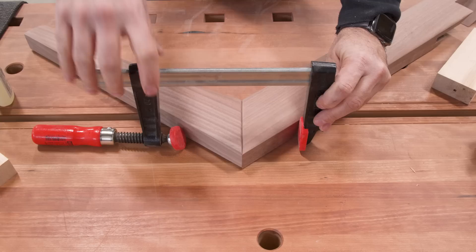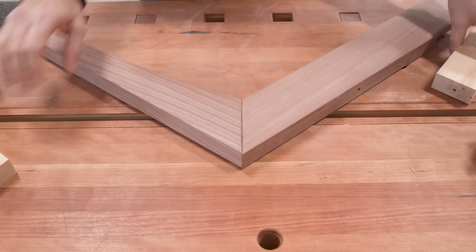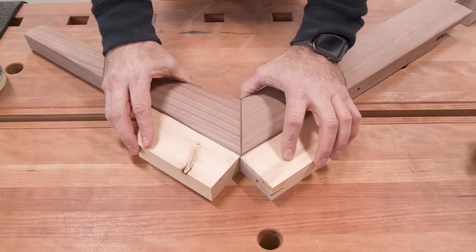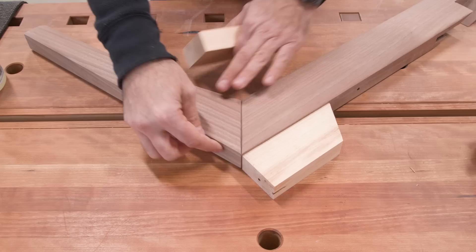There are a couple of different ways I've handled this in the past. One way is to use clamping blocks. You could attach these with double-stick tape or CA glue, but the key is you want to use a soft species of wood. Two-by-four stock pieces are great for this because after the CA glue dries and you need to pop it off, you want the weaker wood to be in your sacrificial block, so you just have a little bit of cleanup and you haven't pulled up any of the walnut.